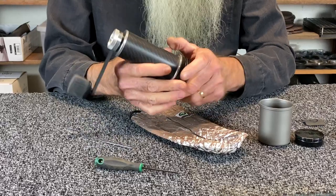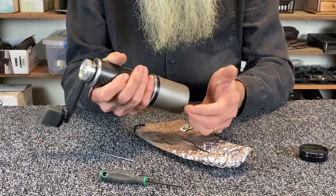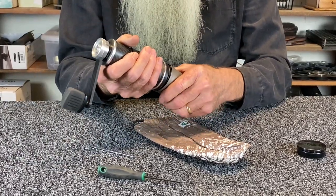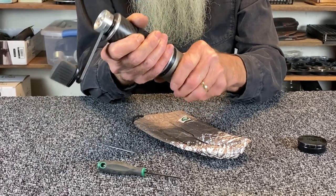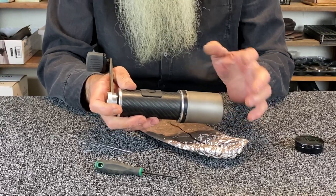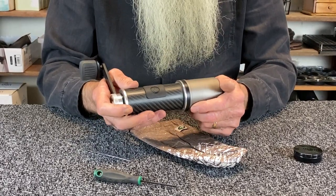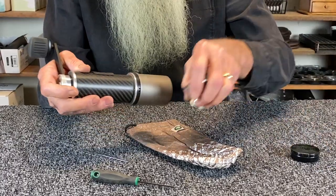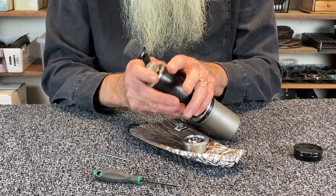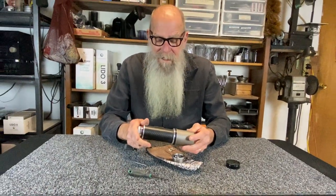The seal was really tricky to work out, because when you just use an O-ring and pull the cup off, it's very aggravating when you throw your coffee all over the place. With this design, it just cracks it off cleanly — it worked out quite well. So a combination of design, materials, and simplicity come together to produce a grinder that starts with 139 grams of burr and adds basically 200 grams to make a complete grinder which holds 30 grams of coffee. Full format, full size, smooth turning. That's the Fixie — that's the x-ray view. Thank you very much.